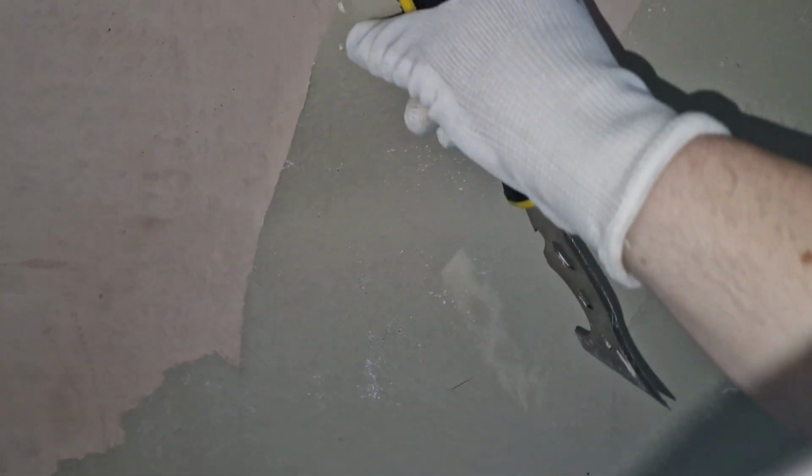Okay, so I'm not sure why this happens, but every time I come to strip the wallpaper off the dining room wall, it happened over on the other side near the dining table, the paint that's on the wall just seems to come off. Now I'm pretty sure it's because it's not been prepared properly, or it's not had a mist coat put on. But yeah, there was a bit of cracking like I showed in the previous photograph, and I've just gone to tidy it up a bit to see if I can do it without stripping it all, and all of it's come off. But the good thing is it comes off like butter, pretty much just peeled straight off. So yeah, I'm not sure why it happens.